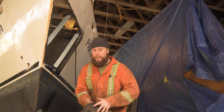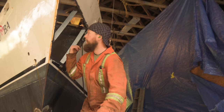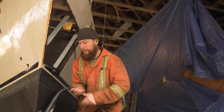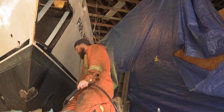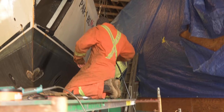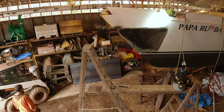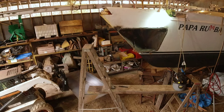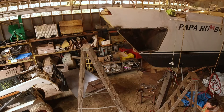I cut it oversized because I had to grind and re-trim this. Before the ribs went in, Logan loaded one of our steel plates onto the forks of a forklift. From there he used the plasma cutter to cut out a new hull plate, which he cut just slightly larger than the plate he had cut out of the boat.